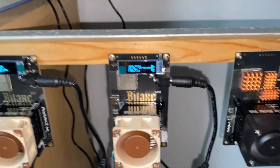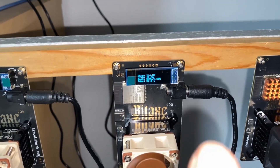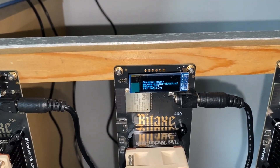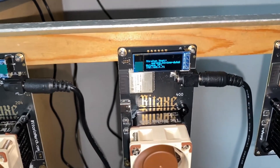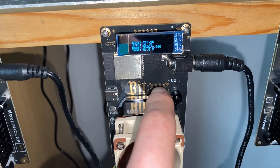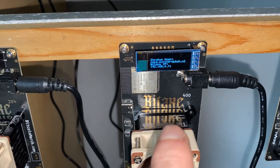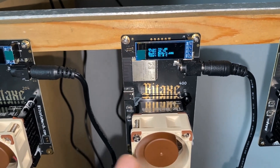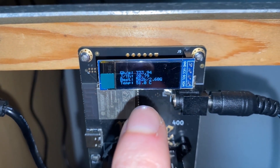A couple of days ago we went on a journey with the BitAxe Supra to try to get it to one tera hash stable. We do have copper heat sinks which I'm hoping will help. We got up to around 900 giga hash but couldn't get it stable at one tera hash. Today we're going to be adding more heat sinks to dissipate heat around the voltage regulator, and putting some on the back as well. Currently we're at around 733 GH/s and the temperature is 51 degrees.